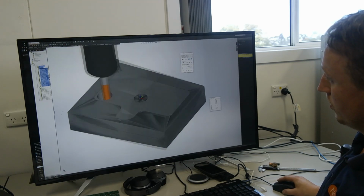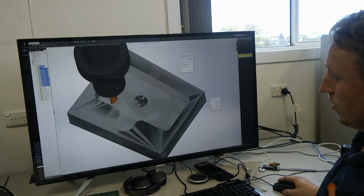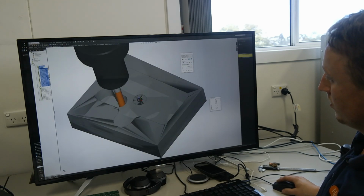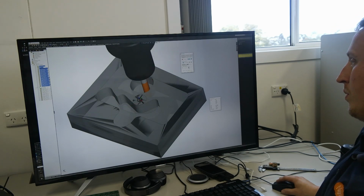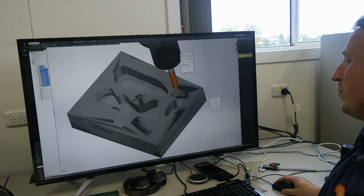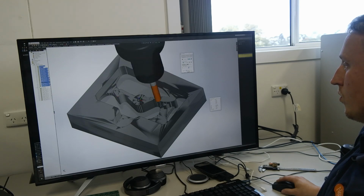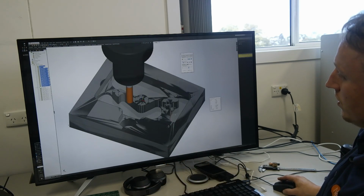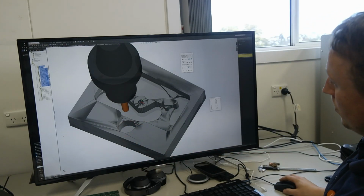And we drill the 5mm hole in the middle for the pivot. Then a large hogging operation with a 6mm end mill. Just remove a big bulk amount of the material. I'll speed that up a bit. It keeps going, it just keeps whittling away at it until we've got the first side done. Then this hole that's been reduced is used to flip the part over.